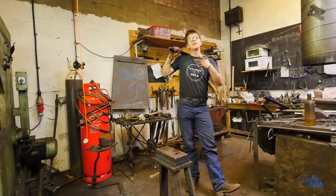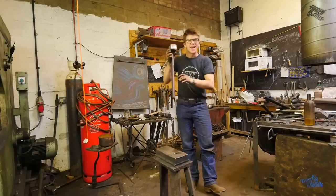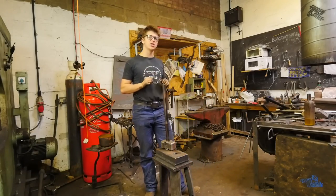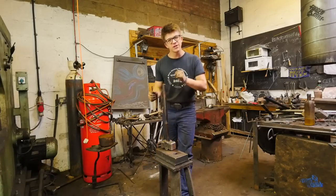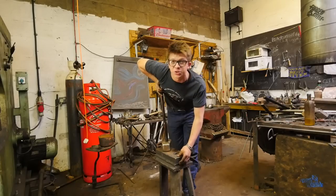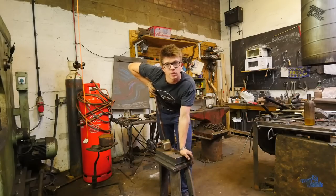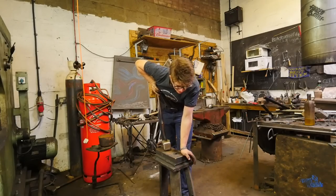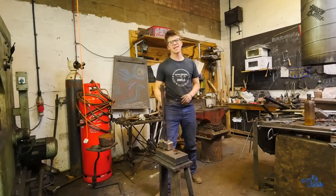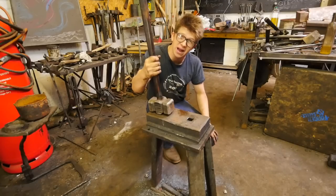The striking anvil is an anvil that I use almost exclusively when I'm working with somebody who's swinging a sledgehammer. This striking anvil is made with a mild steel plate measuring 12 inches by 5 inches wide on the top. In this particular case, it's 2 inches thick — a 3-quarter inch plate and then an inch thick plate. Ideally, your striking anvil would be between 2 and 3 inches thick, with an inch on the bottom and legs welded underneath. Naturally, it's not a hugely heavy anvil — the entire weight is probably only about 75 pounds or so.